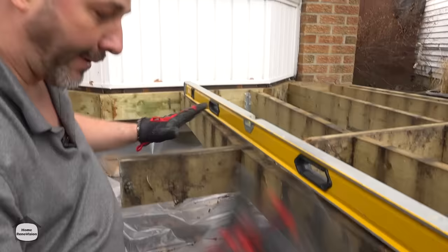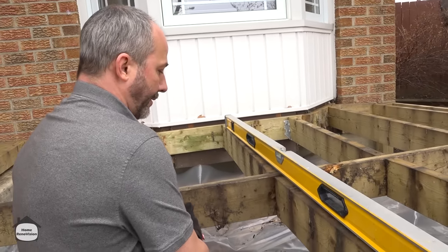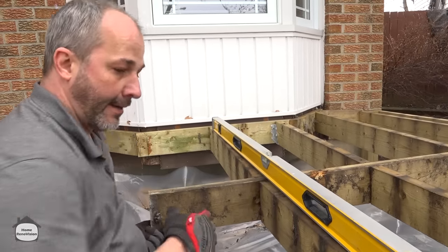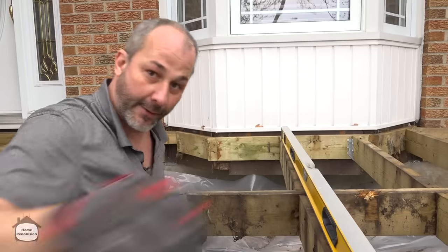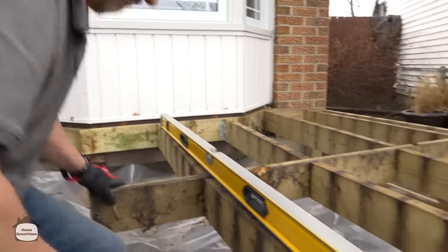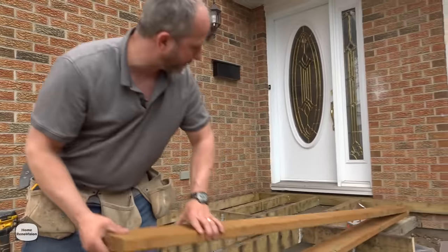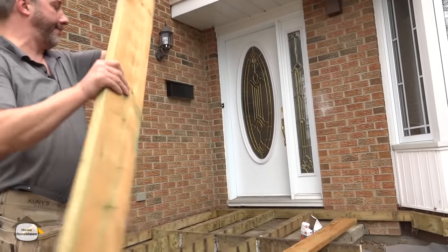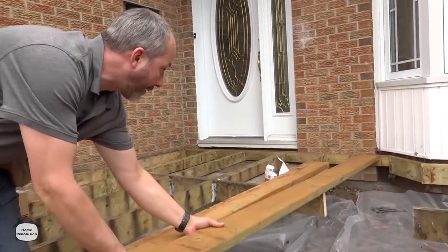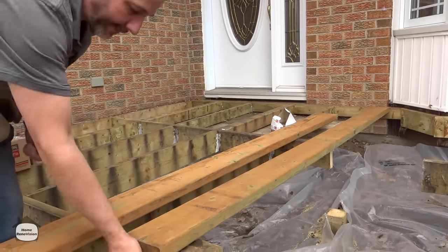When we put in our new piece of wood spanning the entire gap and I lift it into the floor joist, my whole deck will be flush. It's still not level, but now all the load goes from the wall to the outside rim — it's just a matter of fixing those few spots and we're good to go. I'll use a second pair of hands, swing this one around, set it up, and use that to measure so I know I'm perfectly level.